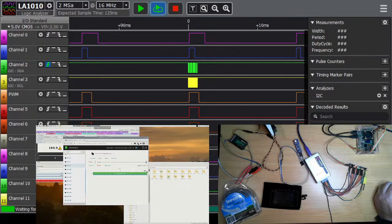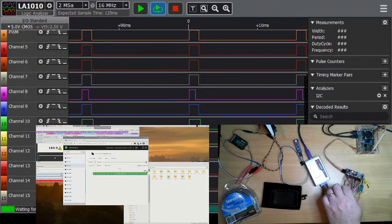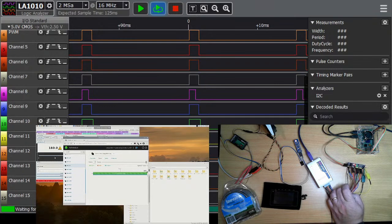So yeah, having 16 channels in one spot is very handy. You can connect these to an Arduino and daisy chain them from the Arduino. So if for some reason the 64 of these is not enough for you off the Raspberry Pi, you can connect an Arduino and use the I2C on the Arduino to give you another 64. And if that's not enough, you can add a second Arduino. So I cannot see where you would need quite so many servos and quite so many servo drivers. But yeah, I have seen projects with a hell of a lot of servos in them used in artwork.